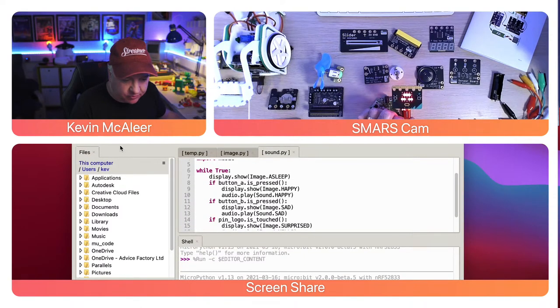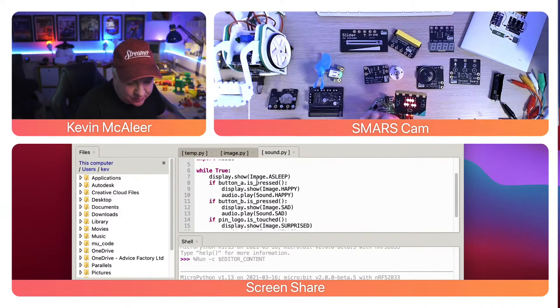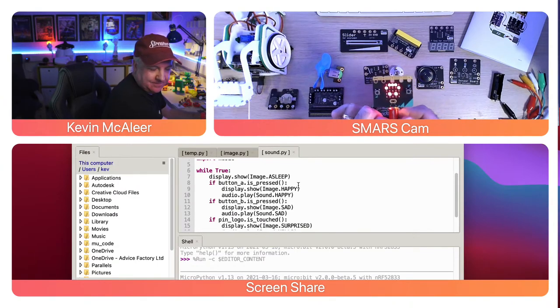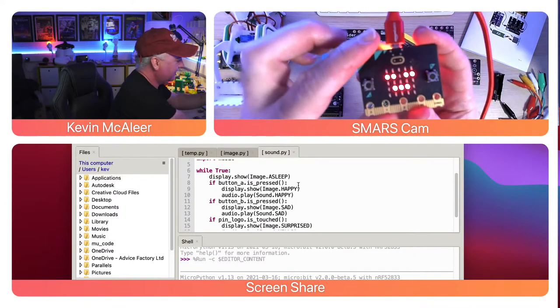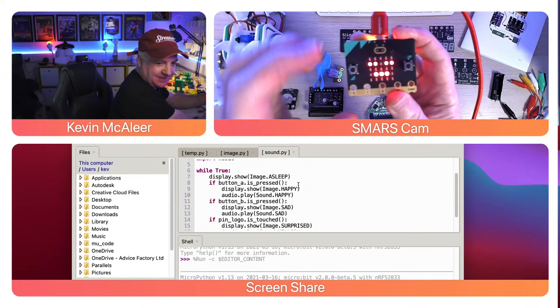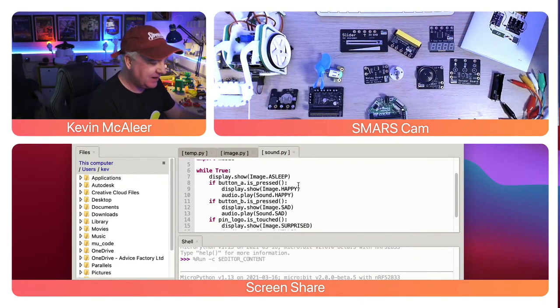And I've just clicked run, so it's now running this code. What it's going to do is, if button A is pressed, then display image happy. So if I press A, which is that one, that's happy. Let me do it that way around. I'm going to press that again. That's the little happy face. And it's also saying audio.play sound happy. I'm going to put this under the microphone so you can hear it a bit better. Hopefully you can hear that.